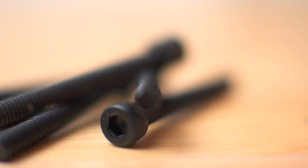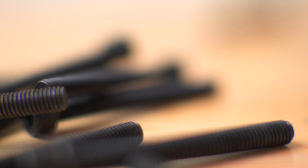Going back to the bolts, this is now a magnified issue because we're not just dealing with a nice flat surface, we're now dealing with a pointy threaded surface. This is going to leave us with a pretty terrible surface quality, but because we're actually printing threads, having all those extra crumbs of material can actually build up stress as we're tightening down the bolt and can potentially shear it and break it. This is just one of the problems that we're going to have to solve in CAD a little bit later in this video.